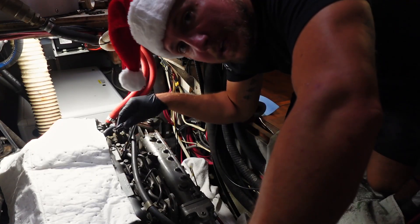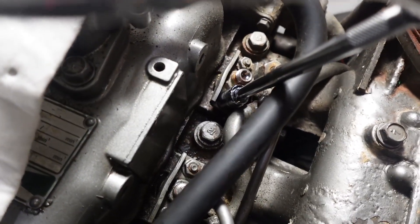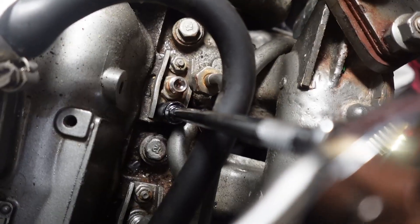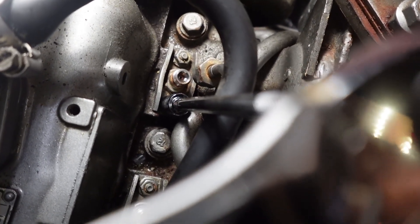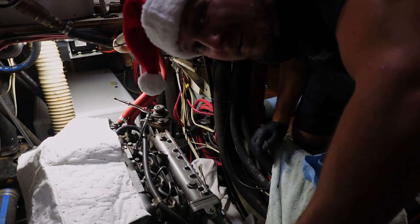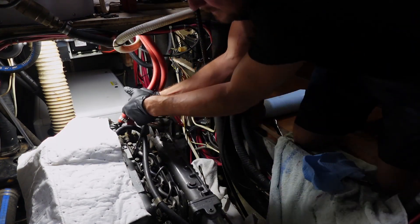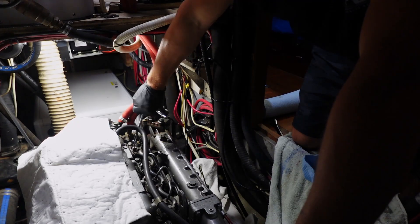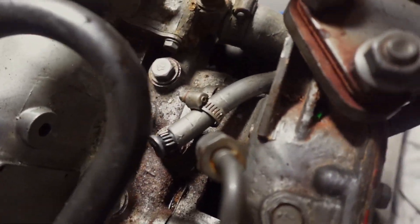Now I'm getting on top of here where the wrench goes on — there's kind of a plate and there's the top of the injector. I'm going to pull these plates off and that should give clearance to get down in there. I grabbed a sample to confirm — it actually kind of smells like diesel. I've got the injectors out now. These are just some return lines still in the way, but I've got all four injectors out — there they all are.